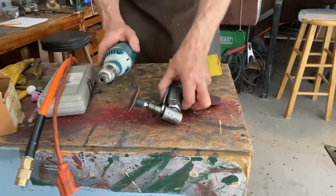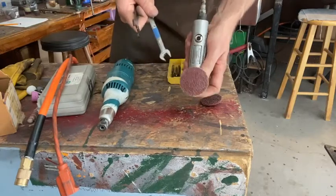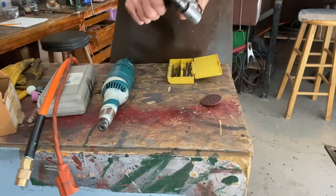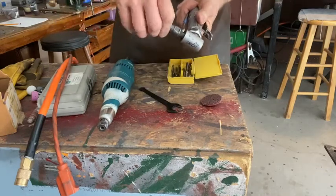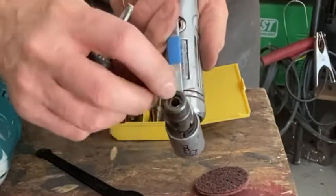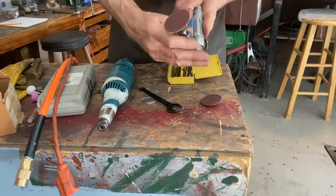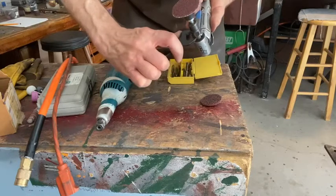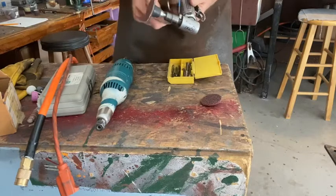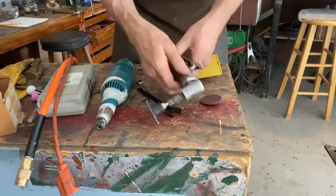I'm going to go with my electric one for the power grinder. You want to use the right size wrenches — there's a wrench that fits there, with a counterclockwise direction. Unlike a drill chuck or Jacobs chuck, this has a little collet inside that crimps when you slide a bit in and tighten down on it. You don't need to over-tighten it — just snug it up so it's good and tight. If it comes loose, tighten a little more, but don't wrench it. Also, don't tighten it down if there's no bit in there, because you'll crimp that little collet too far.